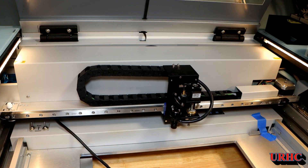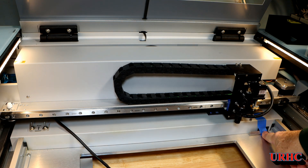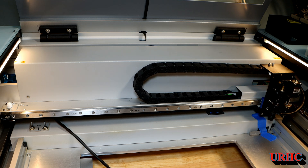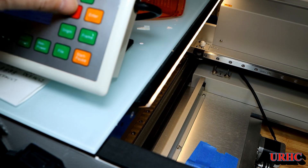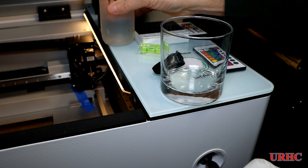Another thing: when you first power this on, I find you've got to push that back and trip that limit switch on that movement. Otherwise it'll sit there and grind away — it won't zero out. Then I also have to hit the escape key. You can see it's still turning there, and I just hit the escape button and it stops that from turning, so it zeroes it out.